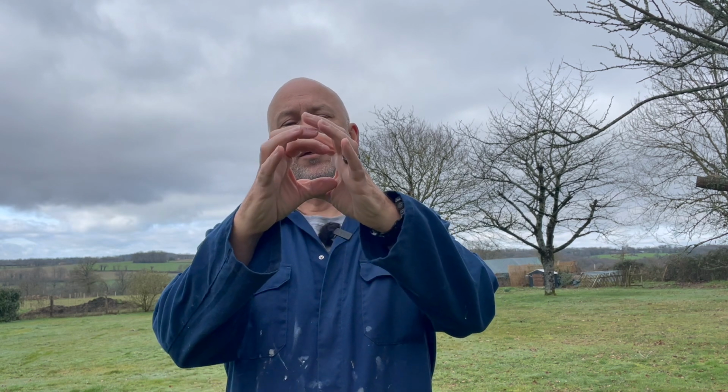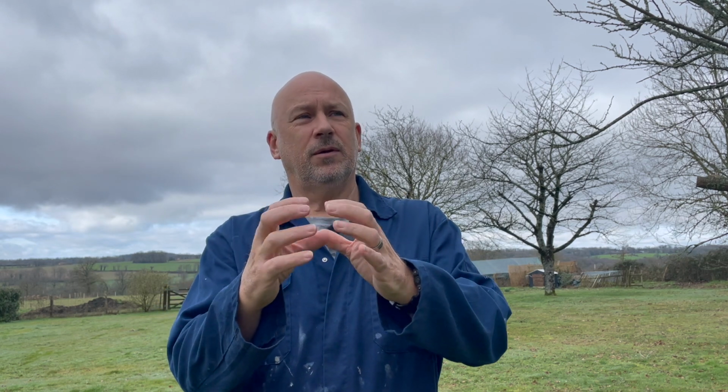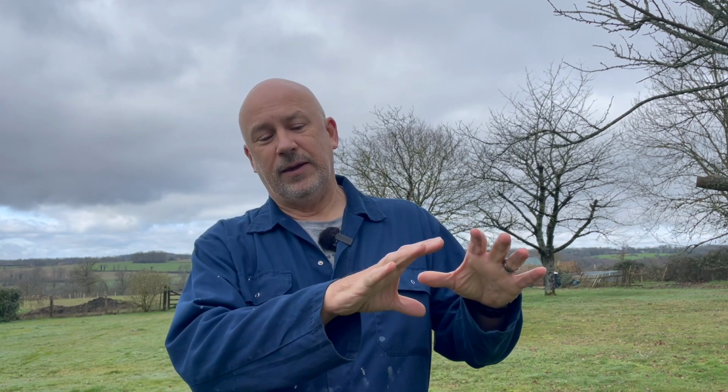So I got under the sink to have a look, and it turned out that the builder had drilled the hole in the wooden worktop the same size as the bottom of the faucet. So it's just sort of sitting in it rather than on it. I managed to get it level again and tighten it up, but I said that's going to be going again.